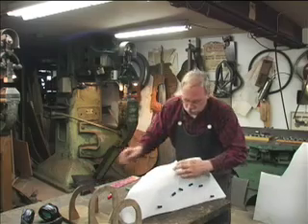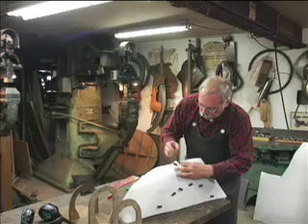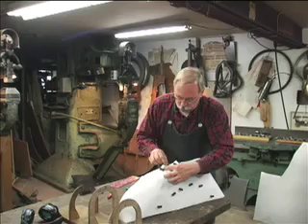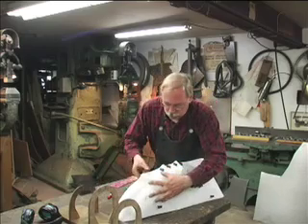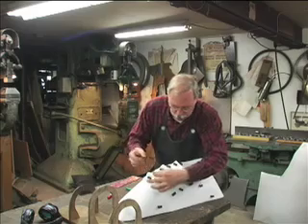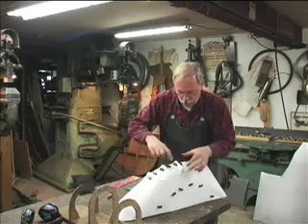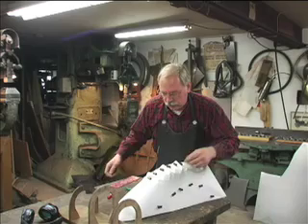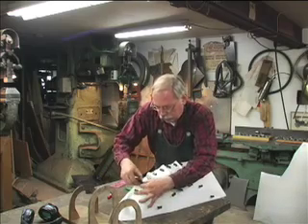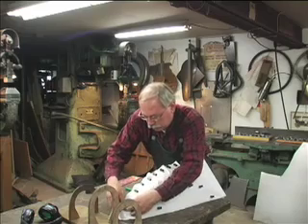The first thing to do is propose where the shrinking is going to occur. Since this is a traditional high crown piece, we could make it in three pieces by stretching — having two sides and a top with a seam down the highlight line — but in this case, since we have the power hammer and we can actually shrink, we'll make this in two pieces.